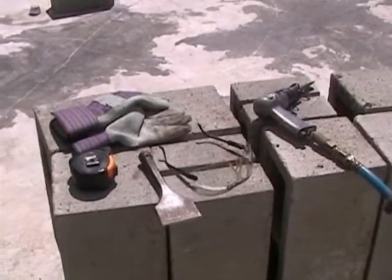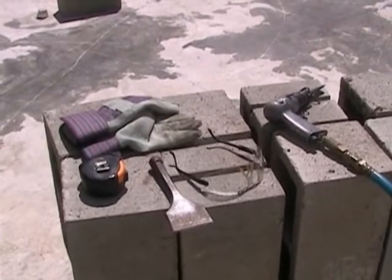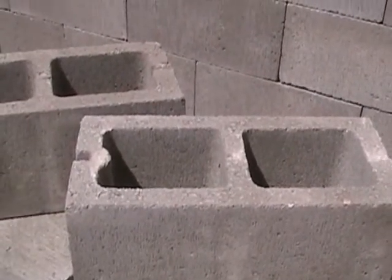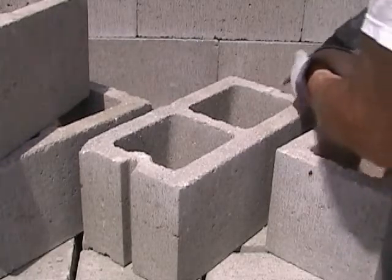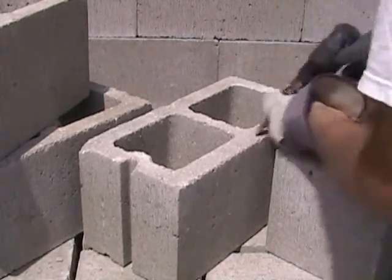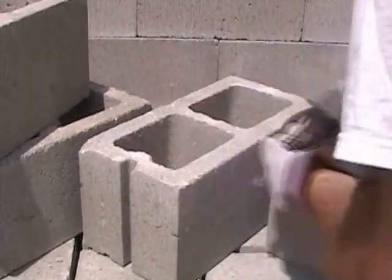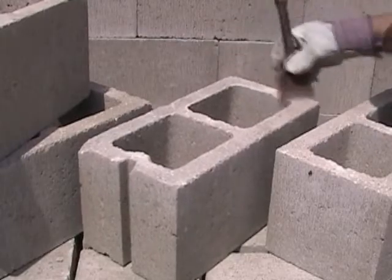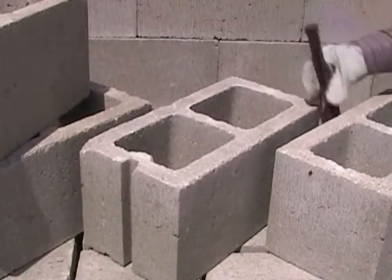These are the tools I use to clean the blocks. The blocks have a dirty edge on the bottom side, and when stacking dry, these ragged edges cause problems. I like to clean them so we have a nice smooth edge. Here's a picture of a block that's been cleaned — the hump is always in the middle of each web. The air chisel makes quick work of any bumps in the block, and then you take the 3-inch hand chisel and run it across the surface to knock off any little slag imperfections from the mold. This ends up with a very flat surface on the block.